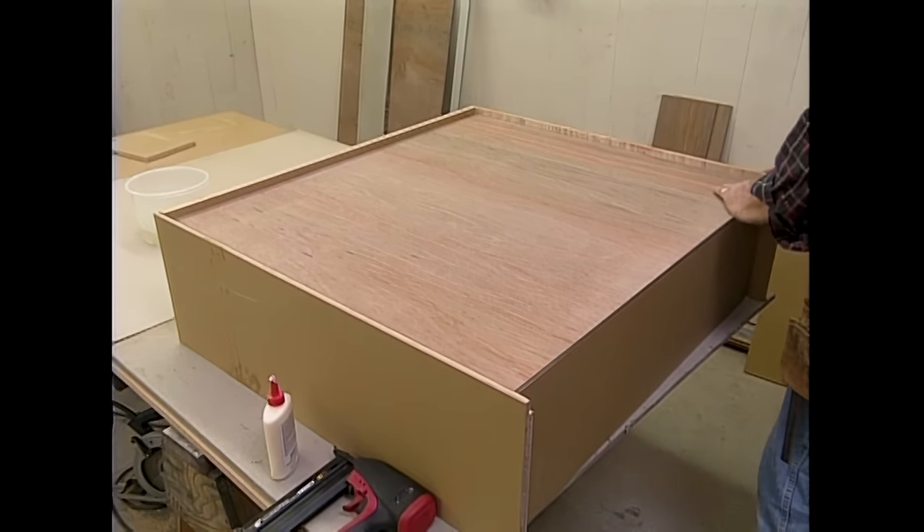Let's put it up the way it's going to go and check it for squareness. On this diagonal I have just about 39, and on this side just a hair under 39 — it's close enough. This 2-inch rail is going to be used to support the drawer hardware, and it will be a place the doors can close against — I'll attach it with a couple screws through the ends. Next thing I want to do is dress up the front edge of this bottom shelf — I'm going to cut a piece about an inch and a half wide, and that will make it stiffer also.